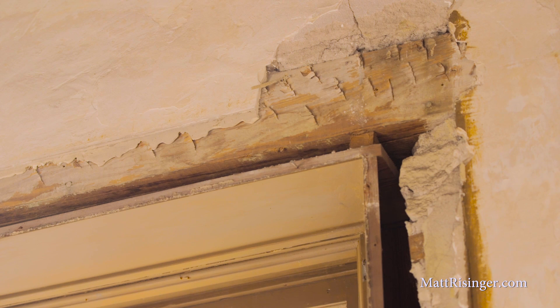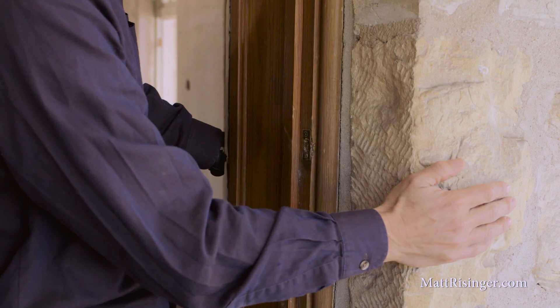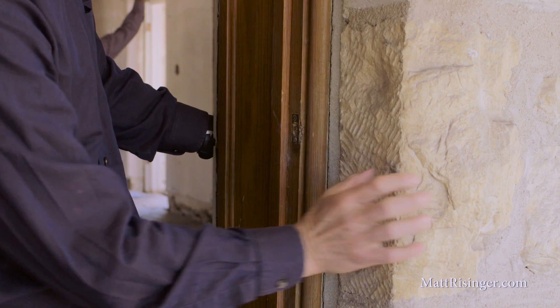Airflow — we want to make sure that we recognize that, though it doesn't seem like it, air can flow both around this assembly and through this assembly. There are cracks, as visible over here, carrying with it a lot of water. The third control layer is vapor — water vapor moving through this wall. As massive as it is, it is open when it comes to water vapor. Water vapor can move from the outside in, and here in summertime in Texas, if this rock wall gets wet on the outside from rain or sprinklers, that moisture is going to migrate through the wall and add humidity to the house. Hot and humid outside, cool and dry inside — hot to cold, wet to dry — both drives are toward the interior.